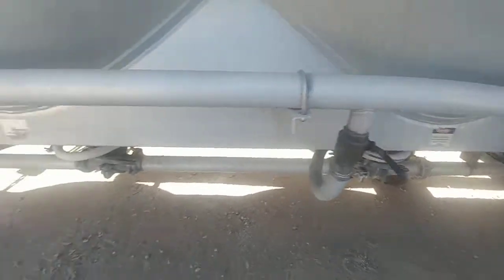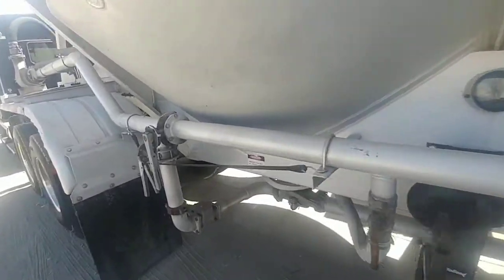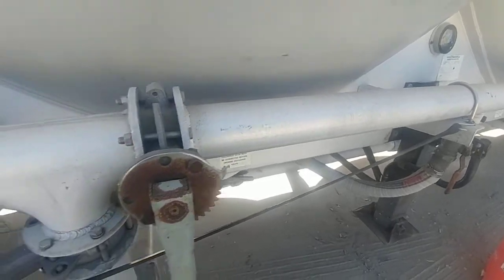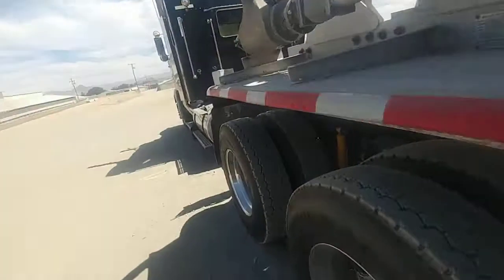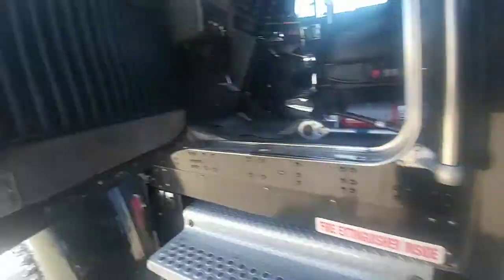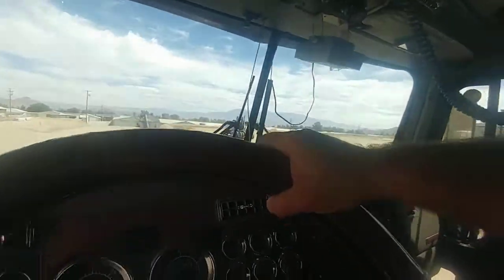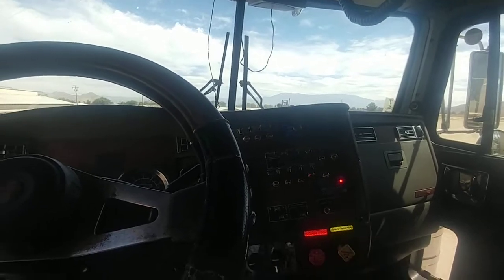It'll get noisy, but let's see what it does this time. My tank air is going to be closed off, my portioning valve is open — it's all going to go down the line. This is a far push with a heavy, dense product, so it's real easy to plug. I run higher RPMs and you don't open the product valve as wide.